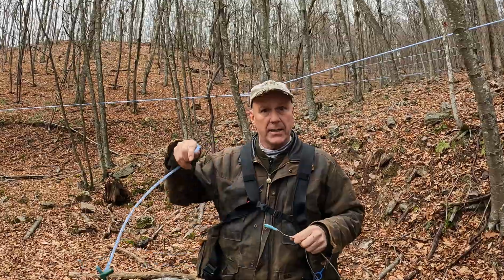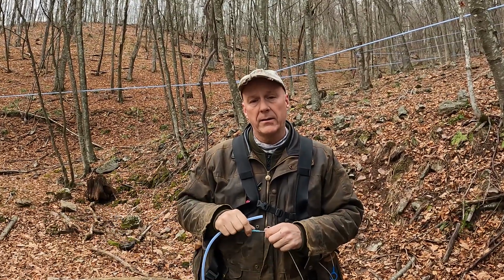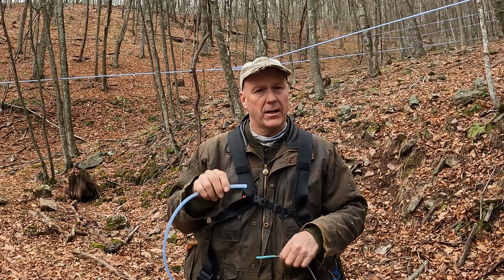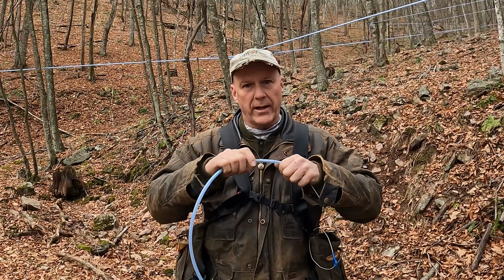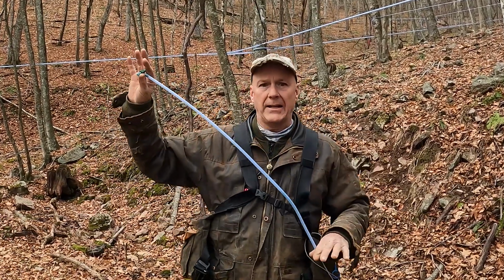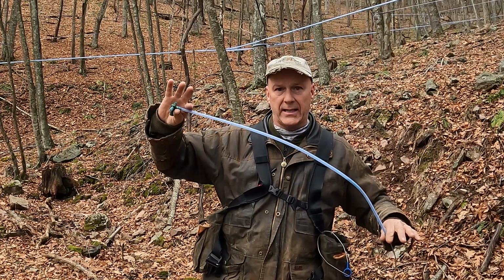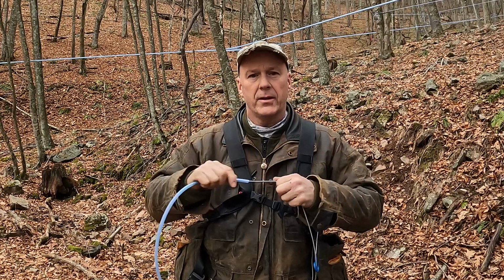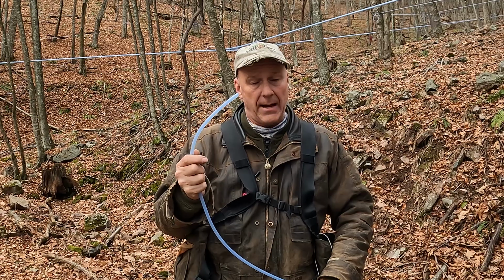We squirt a little bit of water on this. Now keep in mind, as with all of our lines, these have already been sanitized. So if there's any funk left in here, we spray a little water on this, and we start the process of just pushing it all the way up. Now this would be attached on a line, so this brush gets pushed all the way to the end of this, right? And then sometimes you gotta scrub it. So you gotta push back and forth, scrub it, pull it out. And once you do, the next step is putting our taps on.